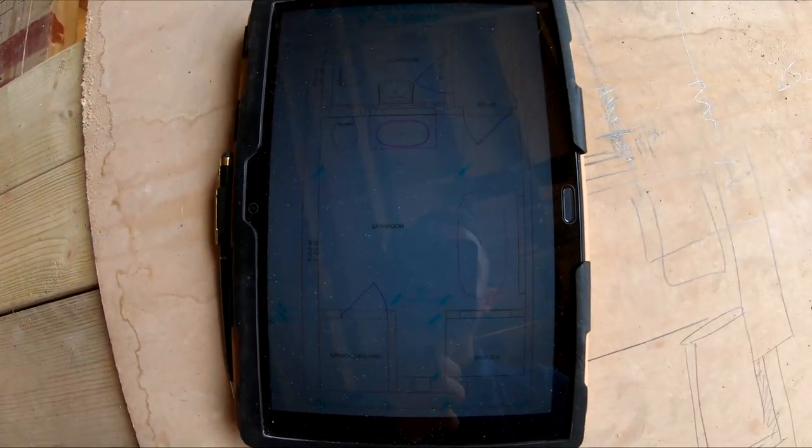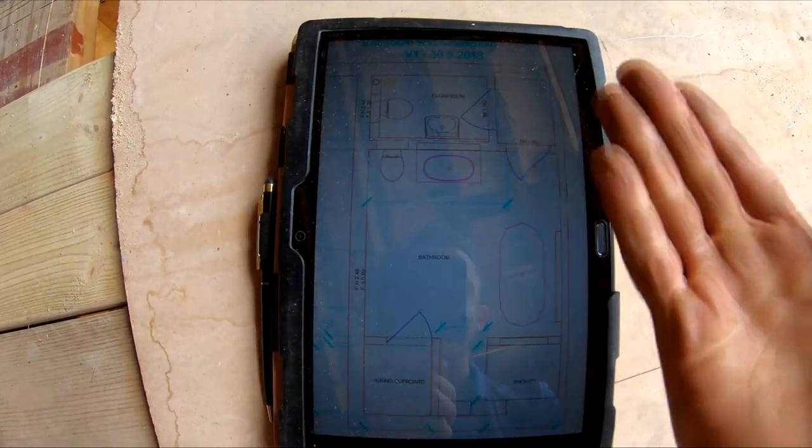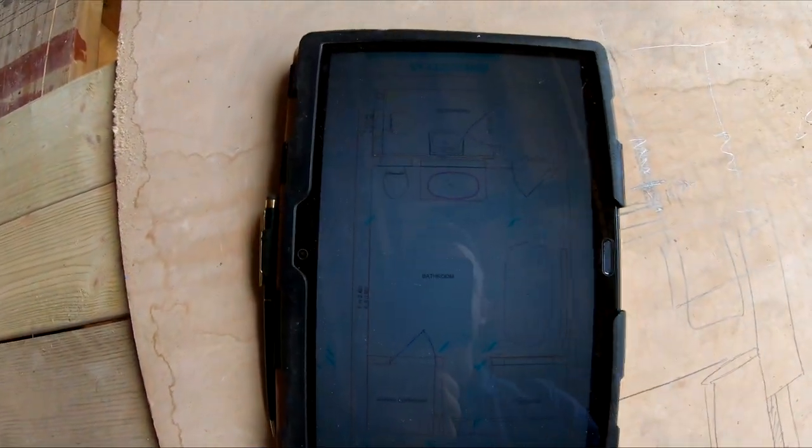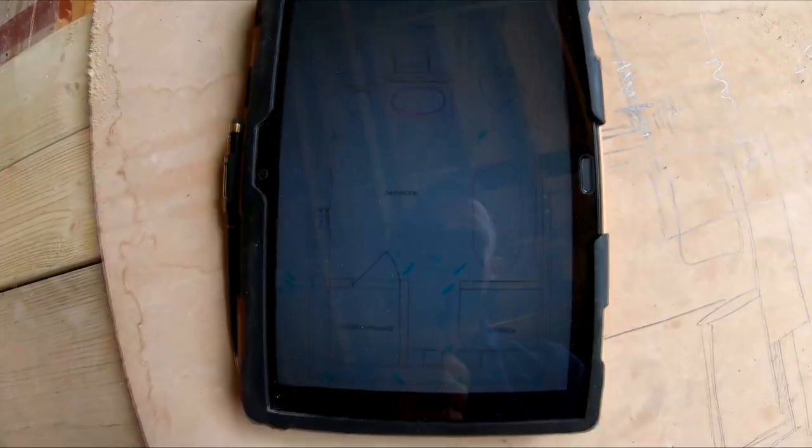Like I say, the Sparkers are upstairs now, just fixing all the lighting, because what we like to do is overboard the ceiling first and then fit the stud up to it. It helps with any sound transfer, because obviously all these studs will be insulated as well with soundproof insulation. That's about it for now.